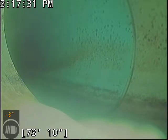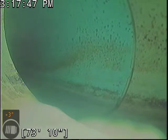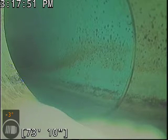They act almost like gold, where it's very heavy and dense, and it goes for any part of your sewer system. They're very sticky and tend to build up, especially in your kitchen sink. But anywhere you have standing water in the line, they just sink to the bottom of it and stay put. And I've seen some households get some pretty gnarly eggshell buildup over time, and it can lead to blockages.